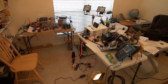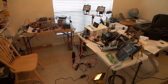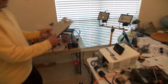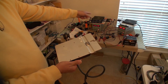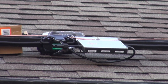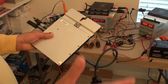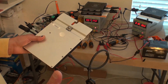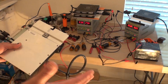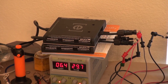We are going to be able to, when the grid goes down during the daytime, harvest the power that the microinverters are putting out. We ran a bunch of experiments here. These are the microinverters we have — we have 28 of them up top, and we're eventually going to add four more. Each inverter is rated at 215 watts, and we're using Sharp 240-watt solar panels. During the last year and a half, I've had days where the system generates up to 44 kilowatt-hours per day.